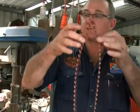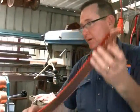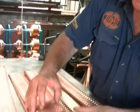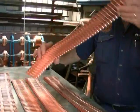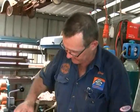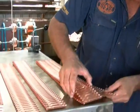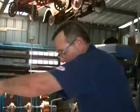So to summarise: two pieces off the machine, through the guillotine, separated, reversed back-to-front, lock-seamed together, then put through the little machine. Then we have one single sheet, which is called a fin — I'll explain that as we go. That fin is simply inserted into the tube. Let's do three or four.